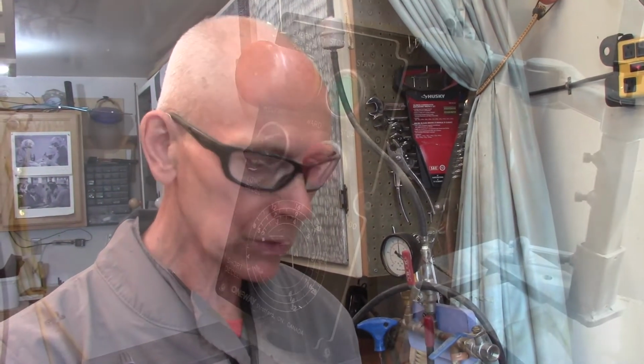So that's the essence of using a skew for making a flat planing cut where you're trying to get the wood even all the way across. There are a number of other cuts that you can do with a skew, like making beads and coves and angles, but what I really wanted to show today was just the essence of keeping your cut closer to the tool rest to avoid the fulcrum effect, where you get that incredible angle and it just snaps your tool down, and it can do a lot of damage. We'll talk about some of those other cuts in another video.